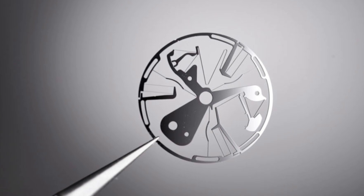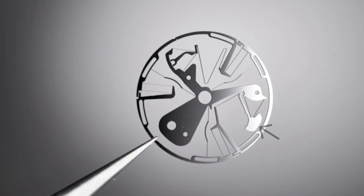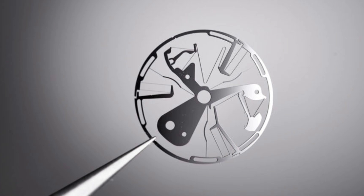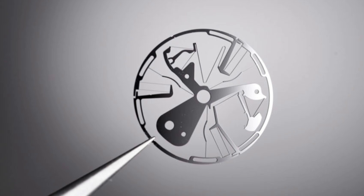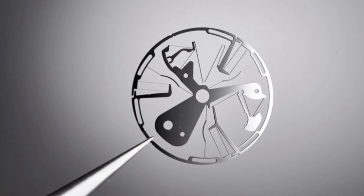On the right-hand side of this component there are two little teeth jutting out, which are able to engage and disengage the escape wheel while deriving that impulse from it, to then bounce the external section in its oscillating motion. This means you can have continued movement allowing the watch to be extremely accurate, without the deviation you would normally expect from a design whereby you have a pivot for each section, resulting in inaccuracies through friction and thermal changes becoming quite pronounced over time. Here you have this avoided completely as it is a purely fluid movement, controlled by the elasticity of the smaller silicon beams.